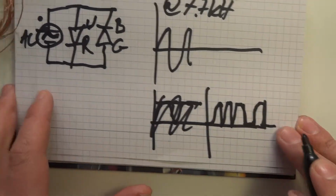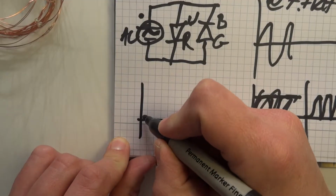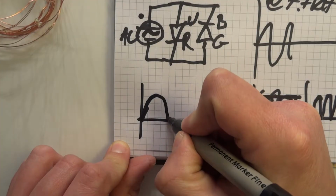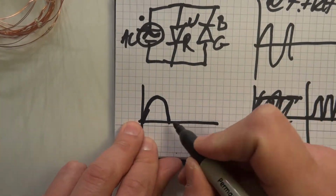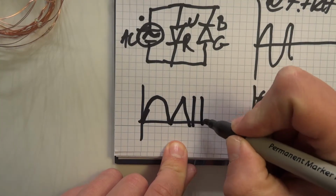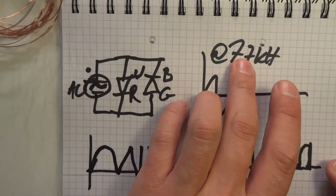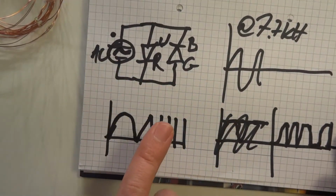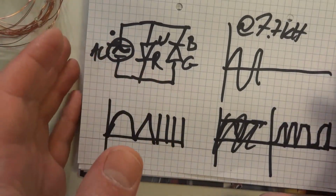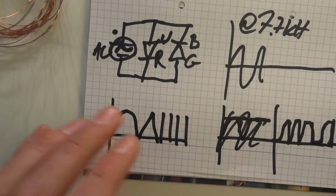And also doing this, and even doing some of the breaks, or changing the whole sinusoid. For example, this standard sinusoid could start doing something like this, or completely doing small points, and your eyes at that frequency would still perceive those LEDs to be lit constantly, but at a reduced brightness. So that's exactly how they achieve this on the 2 cables, which is great actually.